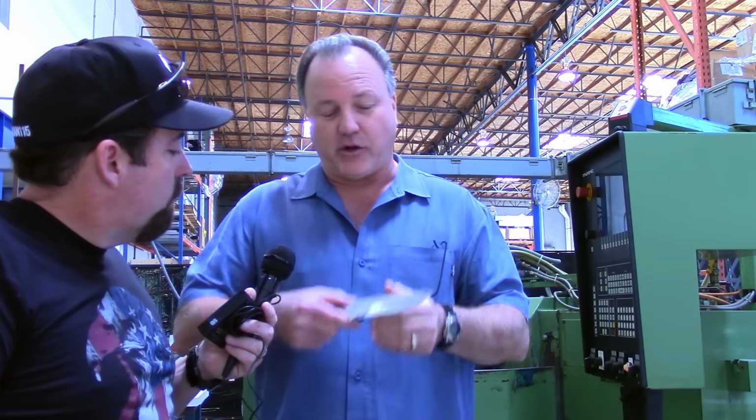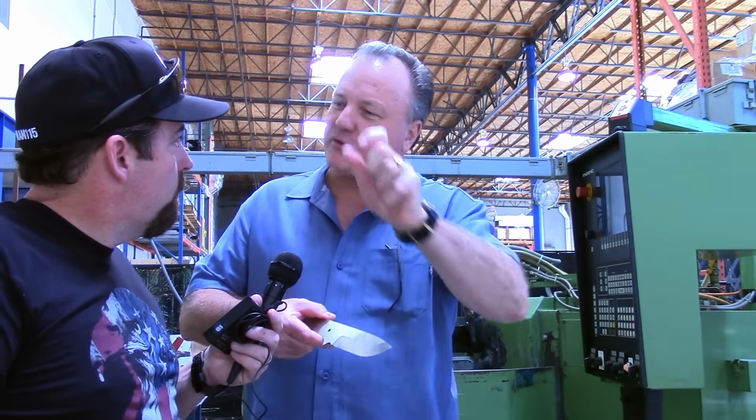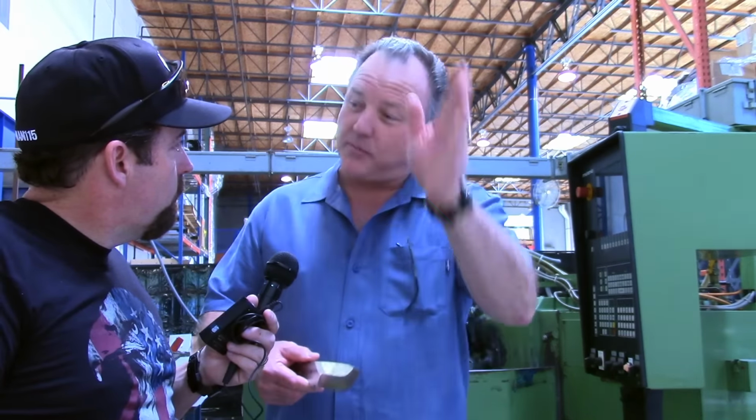It's a hollow grind where you have two wheels coming in and giving you a hollow. Then you have a flat grind, which literally, if you take something flat and put in, it leaves more steel. So it's really a much stronger grind than a traditional hollow grind. The downside from a factory standpoint is you have to run it twice, versus a hollow grind, it's one pass. With a flat grinder, you have to do a right and a left.